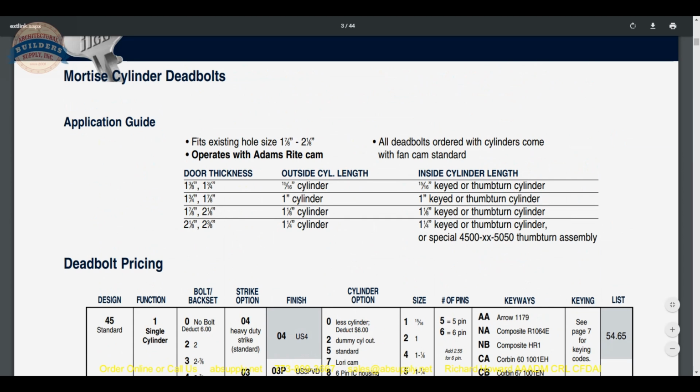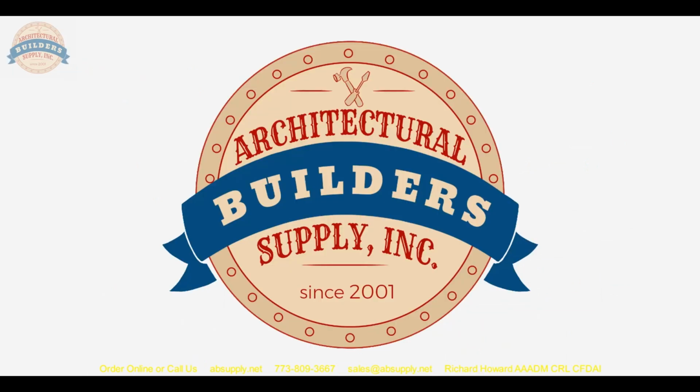Okay, let's wrap up this video. Now, in conclusion on the 7180 dummy cylinder, dummy mortise cylinder from Kaba Ilco. They're used when you're not designing dummy cylinders into the mix initially. You could very likely order, maybe someday down the road they're going to add key control to something. You might have a building so epic that the construction phase is 18 months. There might be 3 phases. And you know that you're going to do keyed cylinders on exit devices. You could set them up to be always passage during construction and not even put the permanent cylinders on site. You could buy relatively inexpensive dummy cylinders for that purpose, I suppose.